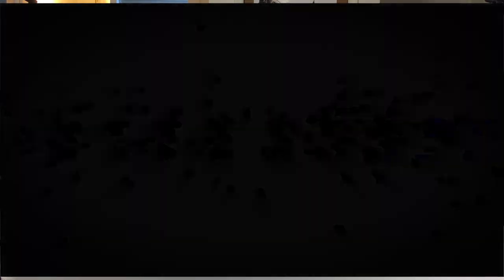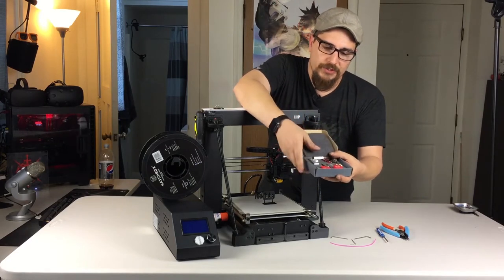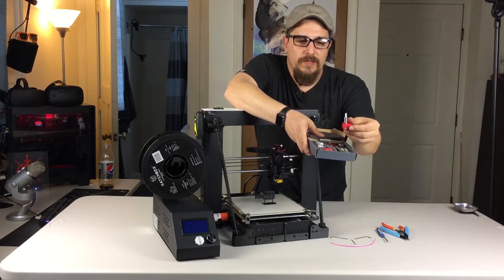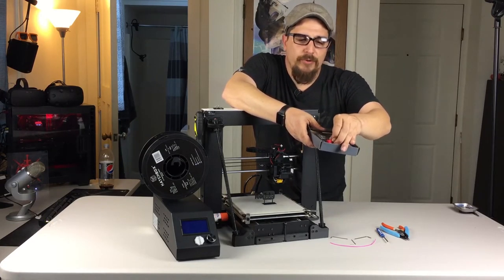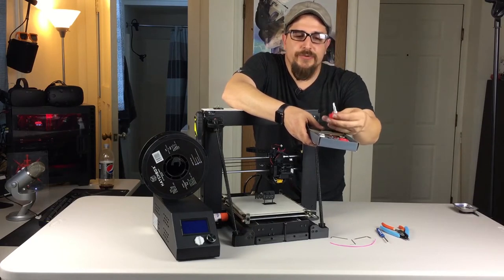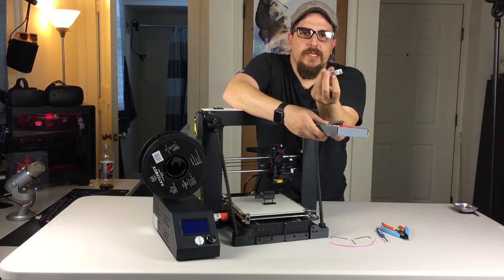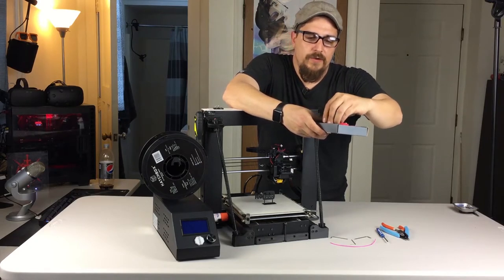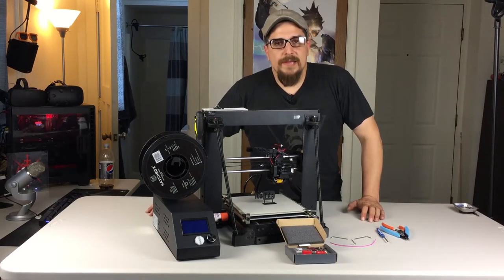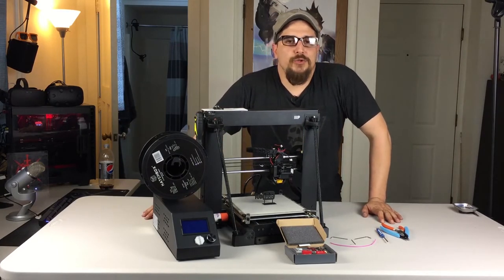This extruder is the HT version and it actually has two hot ends on it. The cool thing with this is they're basically hot swappable, which means you can remove the extruder without having to dismantle the whole heat break and all that stuff like you do with some of the other extruders. Basically comes out with one single screw right there where my finger is — unscrew that and you can slide the whole extruder out. And if you have quick disconnect on your temp probe and on your barrel element, you can literally do a swap out in about two minutes.